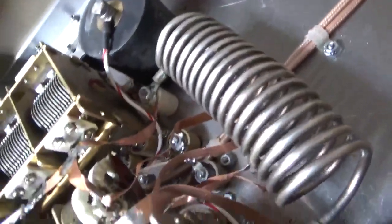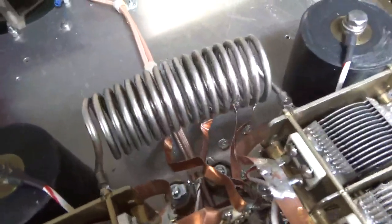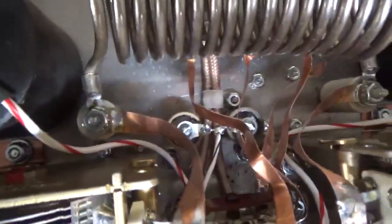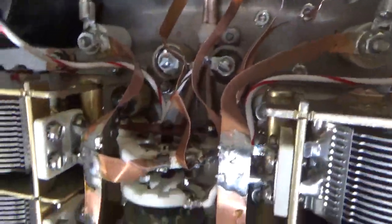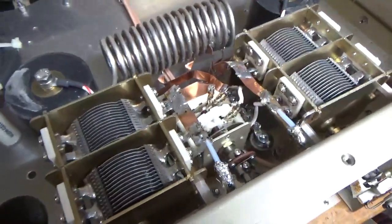I'll give you some better views here. Some of the straps are soldered underneath the coil, with the proper clearance to ground. All the straps have clearance from each other. Everything is soldered to the band switch really nice. Input rotary switch — progressively shorting.